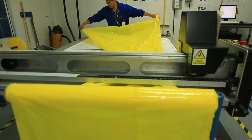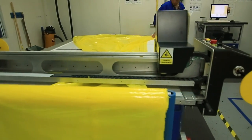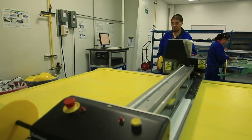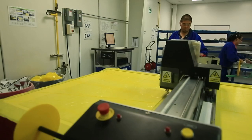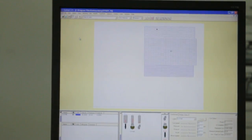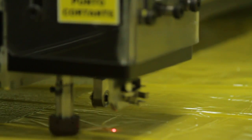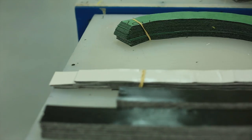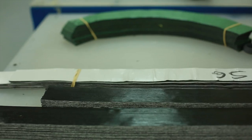Once the fiber comes over to the Eastman table, you'll see yellow plastic goes over the top of the carbon to protect it. It's a vacuum table — the laser plies get set on the table, it gets sucked down with air pressure, and the Eastman will then, using a computer program, cut out the various pieces for the wheel. The various shapes will be gathered and transferred over to the layup tables.